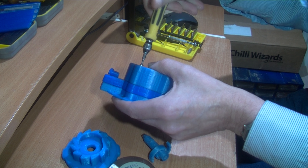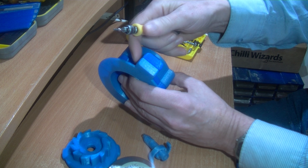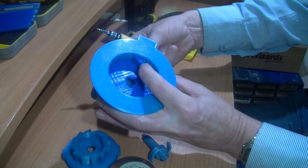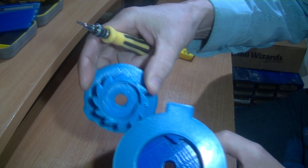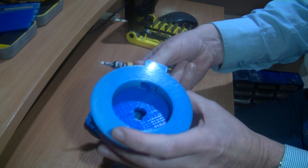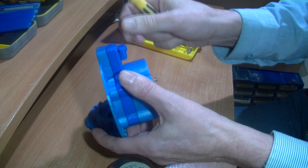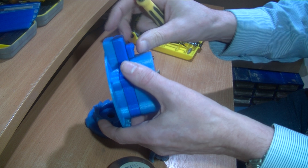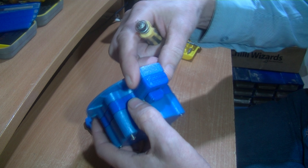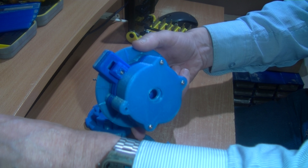These are three millimeter holes and I drilled them out to 3.2. I found this part wasn't totally in line — it's in two halves anyway. This is like a pawl that goes on the main ratchet teeth, the release mechanism on a small spring. It was slipping and seemed to be printed out of line, so I drilled these out to four millimeter.